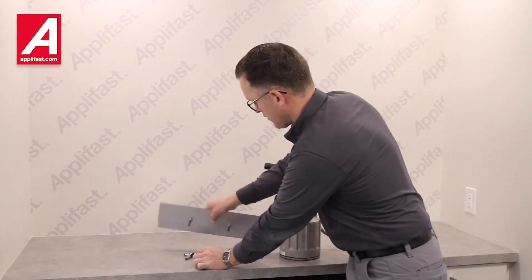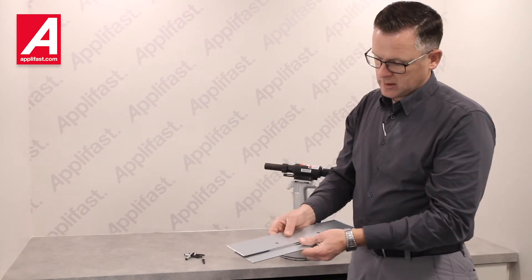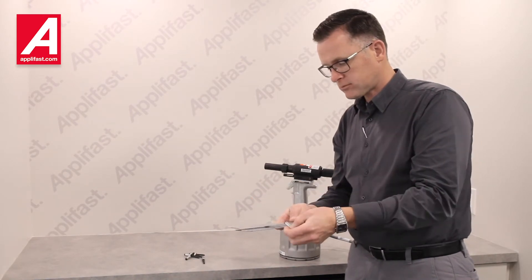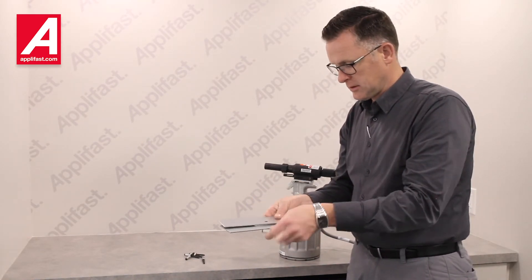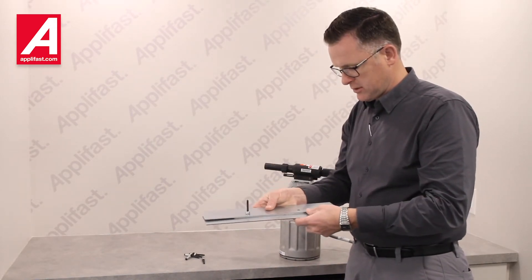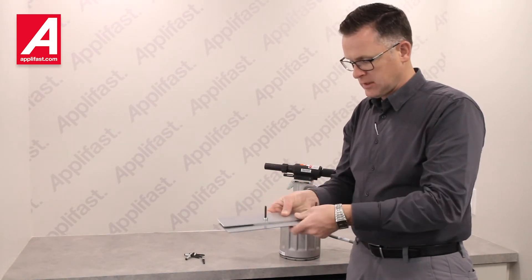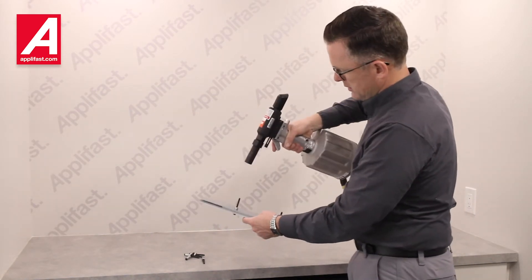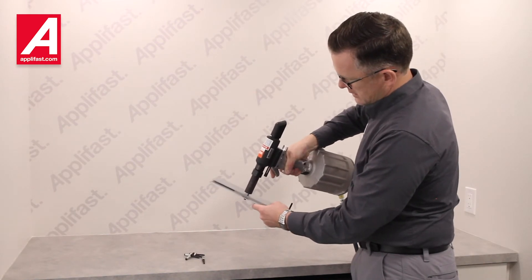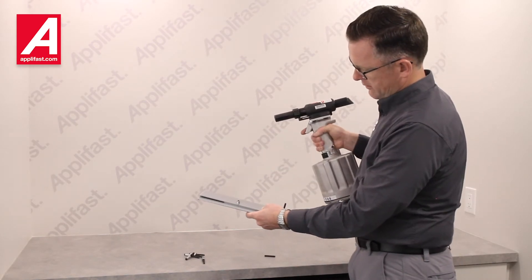To show that in materials, I've got them assembled here — three pieces of material with a hole going through — so I'll line that up to my materials. I can line up the other one at the same time because this will be very tight when I've installed the first fastener. Now I bring my tool to the job; in this scenario it will be face down. I apply the trigger and have to release the trigger to let the tool off the fastener.